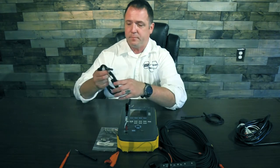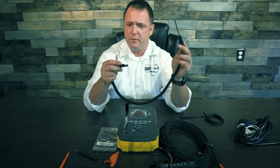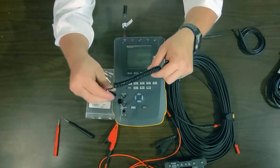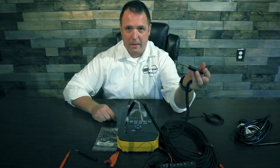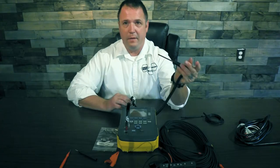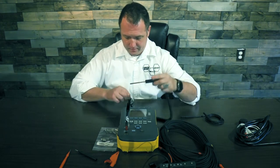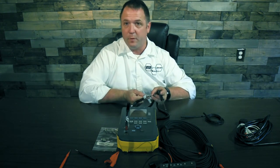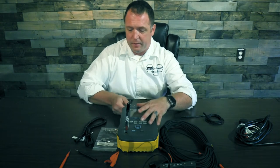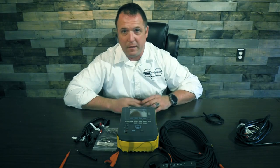Another adapter to pair with that is the ground probe, part number 239-2427. You put it into the fluid bath and connect it to the ultrasound adapter using the familiar ESA-style connector. So you'd have the ultrasound adapter up top and the ground probe down in the fluid bath to test your ultrasound probes or T-probes. You're starting to see just how many capabilities exist with the safety analyzer — things people may have forgotten about or didn't know how to connect.